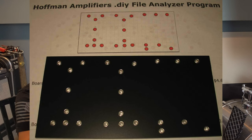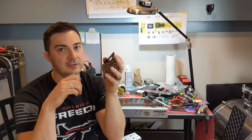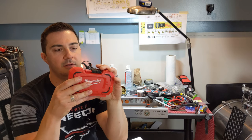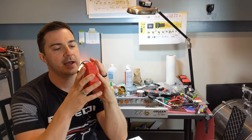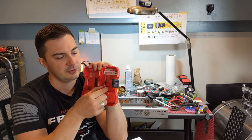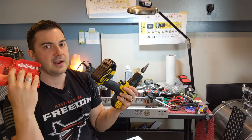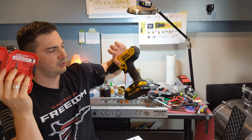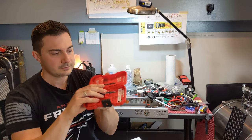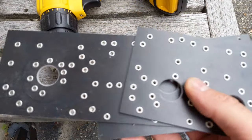You have the option for eyelets or turrets, depending on what you're looking for. I drilled the holes, so getting into the parts you're going to need for this project — you're going to want something like this. This is a Milwaukee step bit set with a couple pilot hole drill bits and two step bits: one that goes up to a half inch and another up to seven-eighths. Between these two, it's everything you're going to need. My drill of choice is the Dewalt 20-volt max — I'll put the link below.